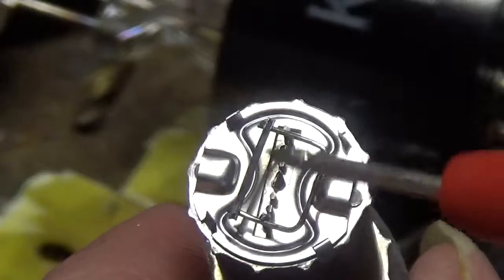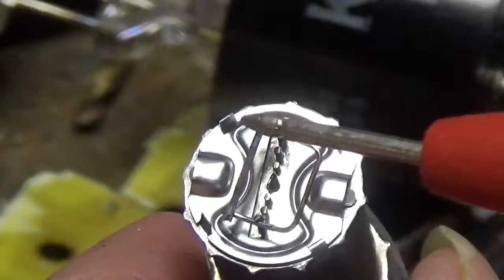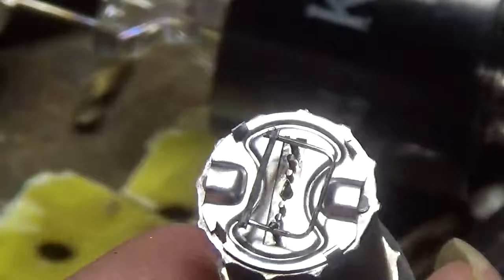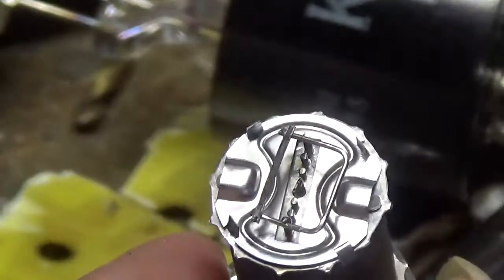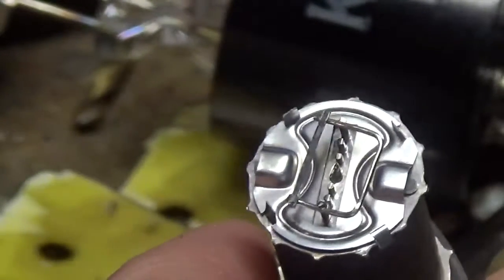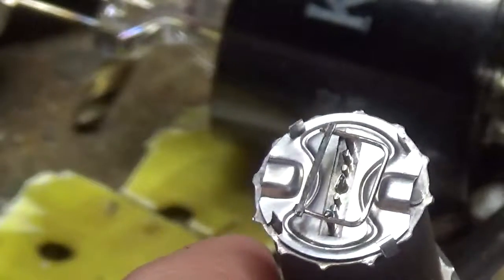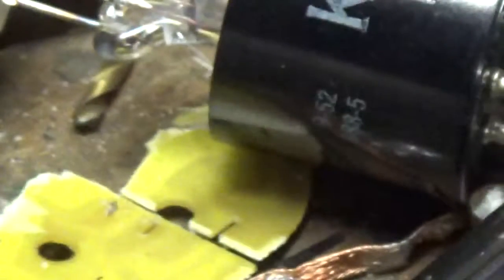That's what heats up. And then the material bounces off of that and accumulates on that top bulb part. And when the thing gets fired up for the very first time and runs, that absorbs all the oxygen particles and any other particles that may still be inside the tube after manufacturing. If it goes white, that means air got into the tube. Seeing as how I'm this far in, I might as well take apart the tube entirely and show you all how it works, for the most part, how it fundamentally works.